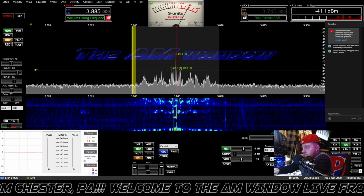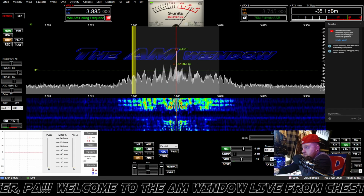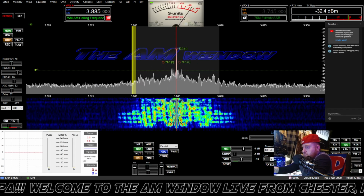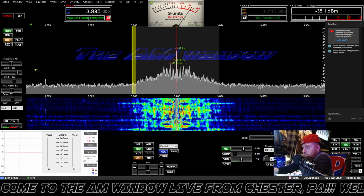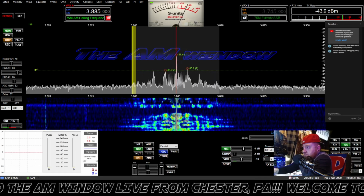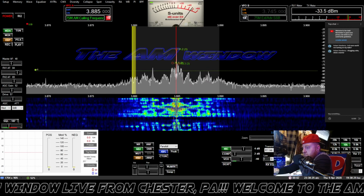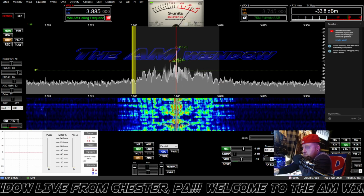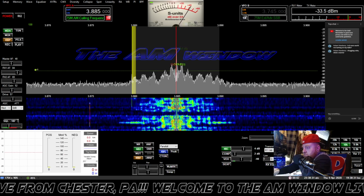Yeah, but how'd you get it down to 25 watts? Oh, I'm sorry, that's what you asked. I have a Variac on the primary of the plate supply, and I just bring that down. That way I don't have to retune all my stuff. I just knock it down to whatever it is, and everything's happy. I just have to lower the feed to the modulator, because there'd be way too much audio on the carrier unless I bring that down after lowering the carrier, but that's the only adjustment.